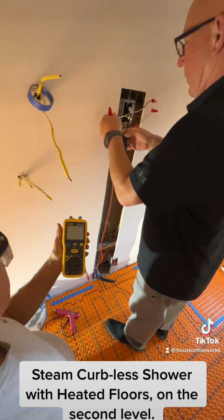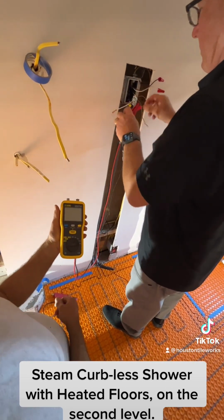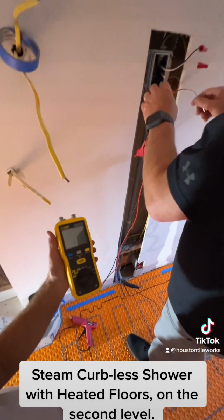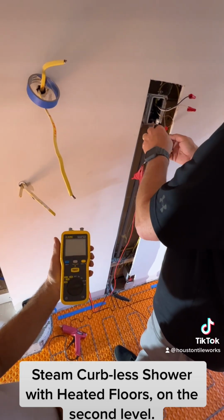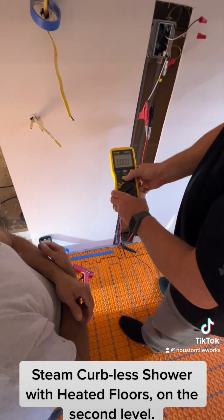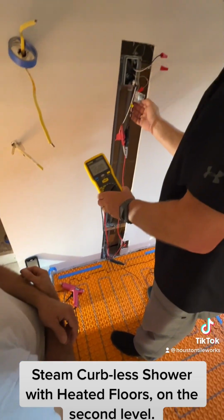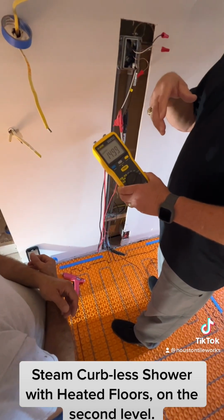So the first test we want to do is for the ohms. Continuity? Yep, continuity. Okay, so that goes there. We want to make sure that wire is out of the way. We want at least 13.65, so we're going to go over here to ohms. Okay, 15.03. This says it should be at least 13.65, 14 or more. So we're within that tolerance, okay?